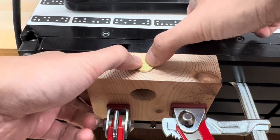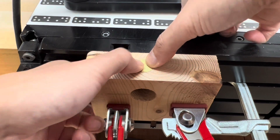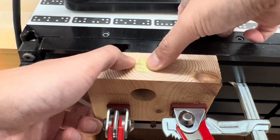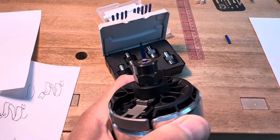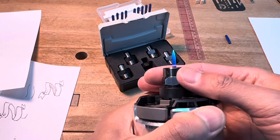Back to the project — I used the Origin itself to create a jig to hold the brass part to start the engraving process, which I accomplished using a v-bit and a one-eighth inch collet, taking multiple passes.